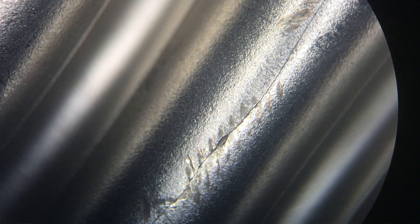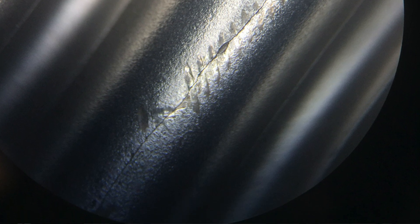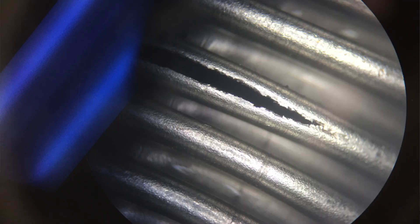When there are circumferential cracks, I first think of either bending or torsional stress. I look for permanent bends in the hose near the crack — evidence of over-bending to a radius smaller than the minimum recommended. I also check if there's any out-of-plane movement which could cause torsion, and look for wrench marks on the fitting or ferrule which could indicate twisting. If there is a circumferential crack without any other cause, we suspect vibration alone, especially if the application is known for high vibration.